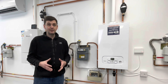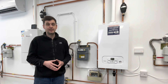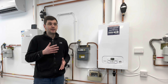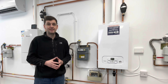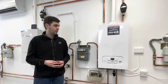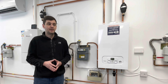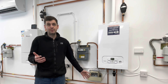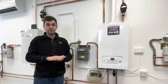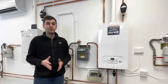If you've got an engineer who's not familiar with how condensate pump wiring works and goes out to fault find on that appliance, he may mistakenly arrive at the conclusion that the appliance doesn't have the correct polarity, so it's not getting a live feed. I've seen engineers in the past start quoting for new electrical feeds to appliances, new fuse spurs, new boards in some cases - when ultimately all they need to do is empty the condensate pump. That lowers the water level, the switch drops, makes again, and then you have power.